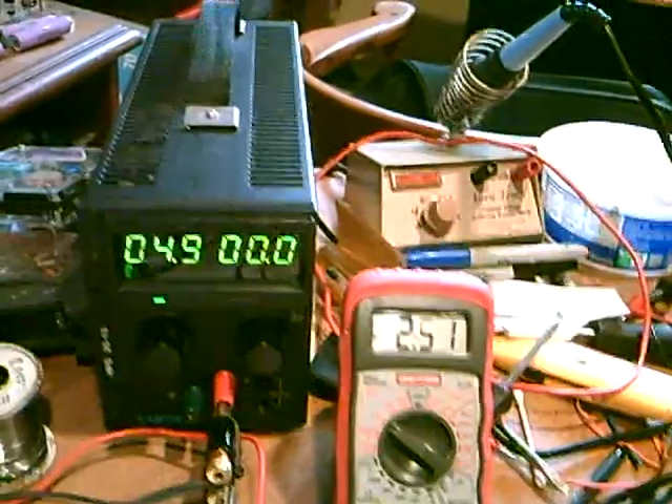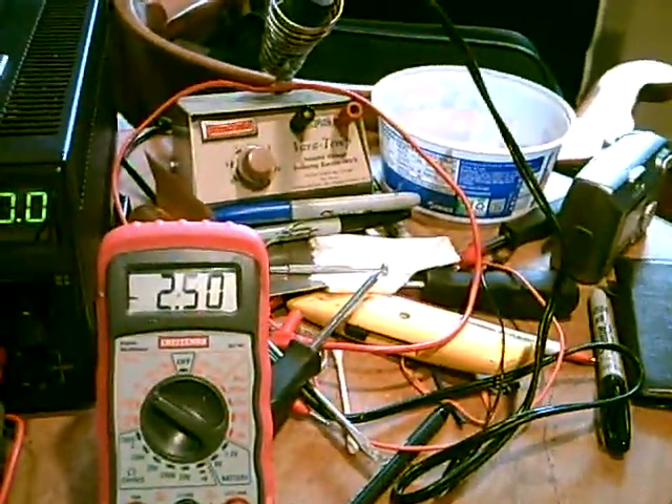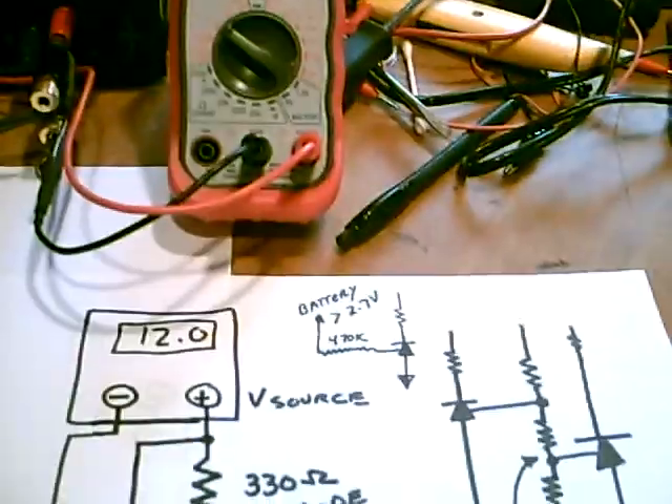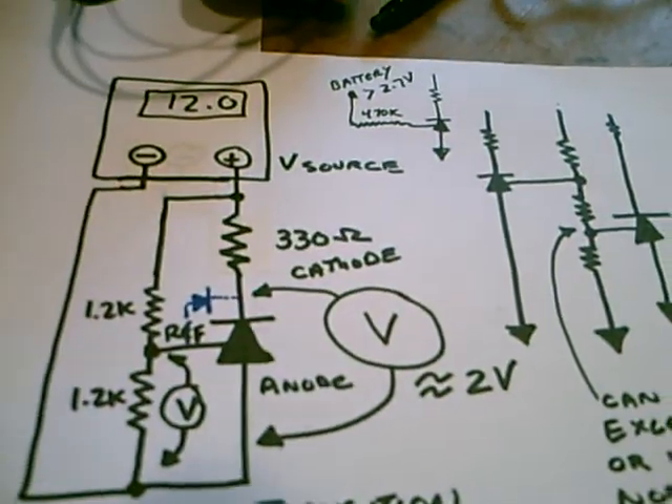In this setup we have here, we have approximately 5 volts going in, and there's a voltage divider to change that to one-half, so we're at 2.5 volts. The normal reference voltage for these is around 2.5 volts.